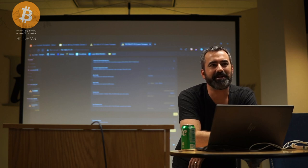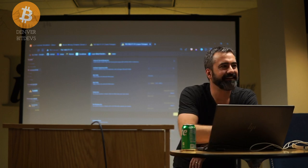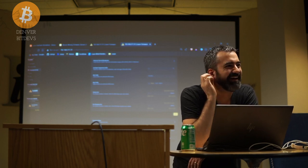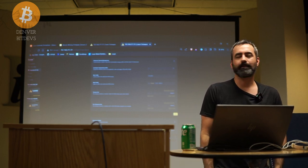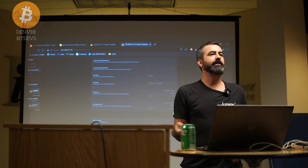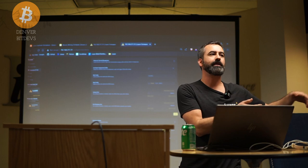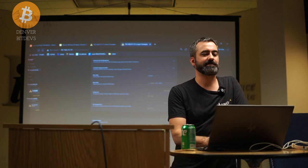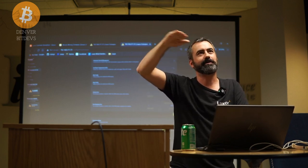It's actually, in this big of a room, it doesn't sound horrible. How would it sound without LuxOS? Because you said the original operating system does not control. Yeah, that's what it would sound like in a warm environment plugged into 240 volts with Bitmain firmware. The fans will be on at 100%. Now, if it's really cold, they might be running like 70%, maybe lower. They're super loud, like 80 decibels, maybe more. I don't know. And the decibel scale's exponential, just like the Bitcoin price chart.